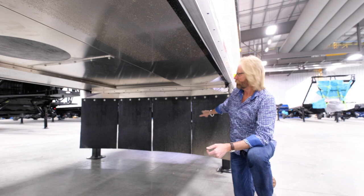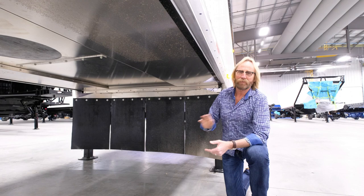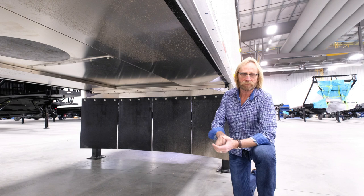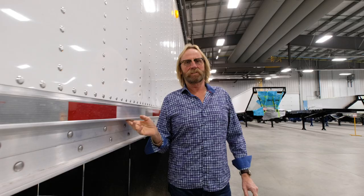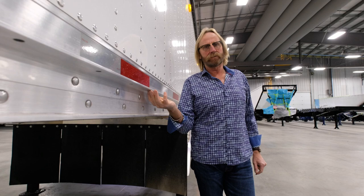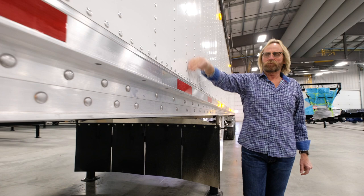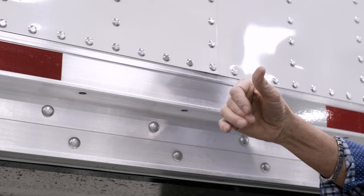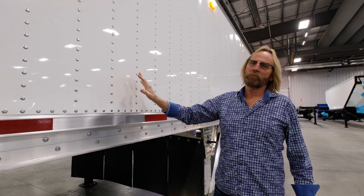Directly behind the closeout sheets is an optional four-piece rubber belting flap — heavy belting to protect the landing area and all components behind it, including the hoppers, from stone and debris from the roads. The two-piece lower rail is also vented between each zed post section, allowing condensation and moisture between the two walls to escape and keep that area dry.